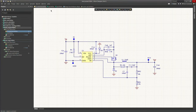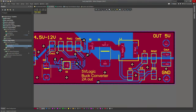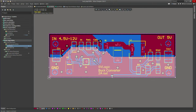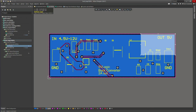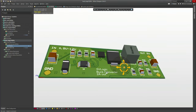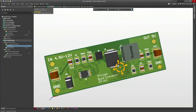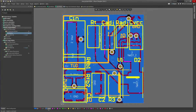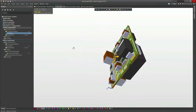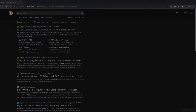At this point it's time to design the PCB. I made two versions — one is bigger with all components on one side. I did this because I've never used these components before and need to nail it on the first try. If I go directly to the tiny circuit and something doesn't work, troubleshooting would be awful. So I'll get the big one working first, identify any corrections, and then apply them to the small one. I'm ordering them together, so I can't correct too much.